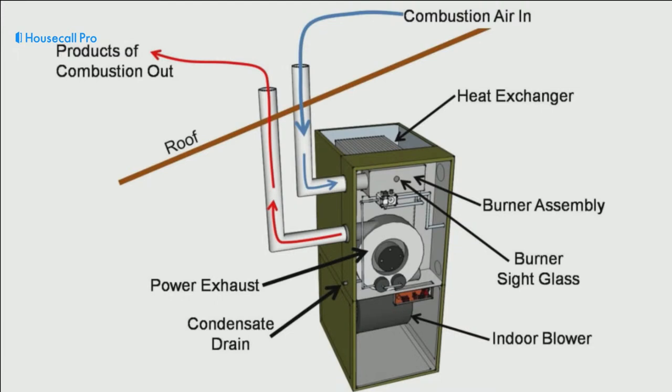Check the intake. It should be 0 parts per million and 20.9% oxygen. If it's different than that, there's a good chance that you're recirculating flue gases from the exhaust. It happens more frequently than we care to admit. If you've ever had a 90% furnace that's all rusted up and damp on the inside, you've seen this. Yep.